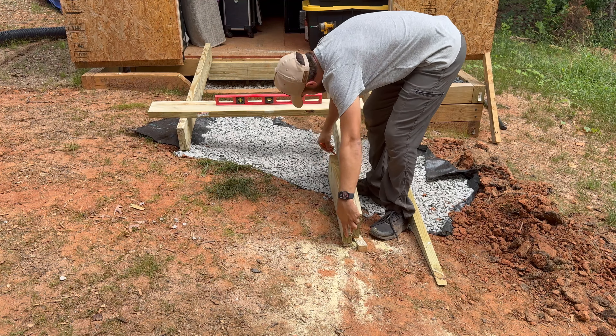It's time to assemble the ramp. I'm using two-and-a-half-inch GRK screws — a little pricier than other screws but very good screws that help prevent wood splitting. For each of the joists I drive three screws. Then I attach the ramp to the shed using three-inch long structural screws.